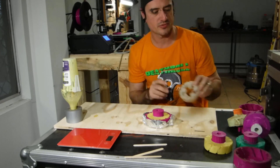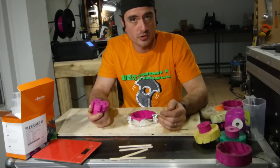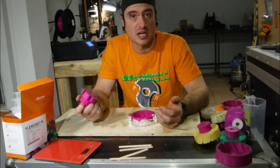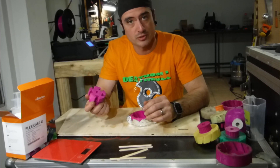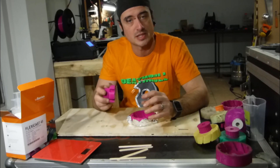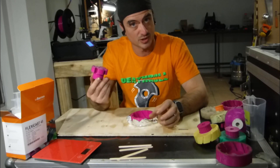We're trying out some different stuff for combat robotics. I want to do a mini series on robot drive because it's an area I'm normally quite terrible at. I tried brushless drive at the last competition for the first time and it worked really well. So we're going to start off on wheels, then go onto a drivetrain. We'll put a brushless prop drive NTM motor onto a Banebots P60, wire it all up, put it in the chassis, and do some testing to see if these wheels really work.